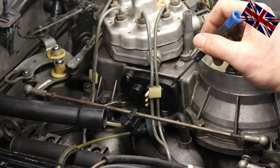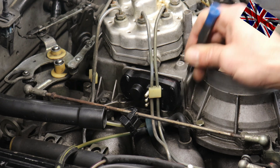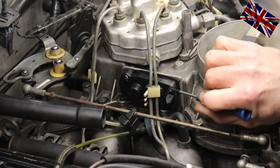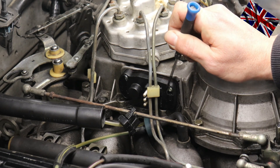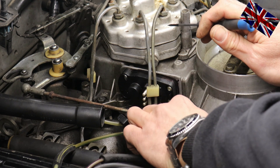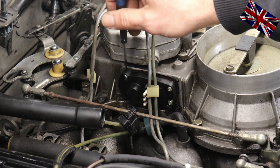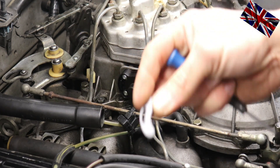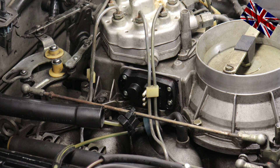Next step: take a small Phillips screwdriver and gently remove the covers of the screws. The old plastic covers will probably be brittle — we will replace them afterwards with new ones. You can see the two screws sitting on elongated seats, so you can slide the housing of the potentiometer upwards and downwards by a few millimeters to alter the position of the brushes on the counter contacts. Same procedure with the screws on the left-hand side — we will remove them all.